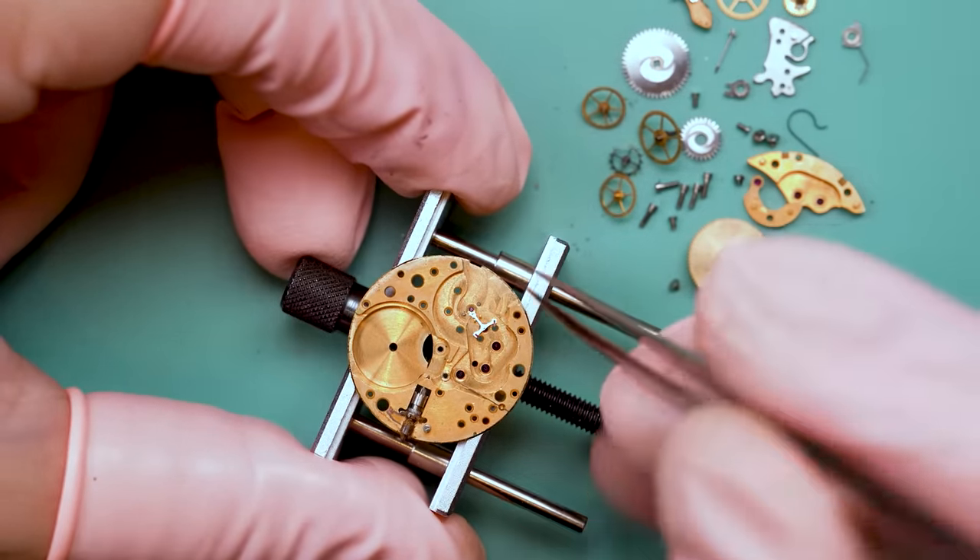Now we need to put it into the ultrasonic cleaner to get off any dust or polishing compound. Looks better already. So the plating process goes like this: first we put it in this solution which is an acidic cleaner, then we get our power source ready. This is really important because we have to set it to the proper voltage and current — if you use too much, it will not plate correctly and it builds up; if you don't use enough, it gets patchy and has black marks. After it's been in the acid, you take it out and rinse it in distilled water before it goes into the plating solution, which is basically a liquid that has nickel dissolved in it. The negative goes through the actual part itself, and the positive goes through a plate of nickel, and then once you turn it on, it goes.